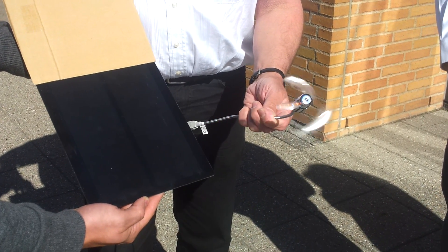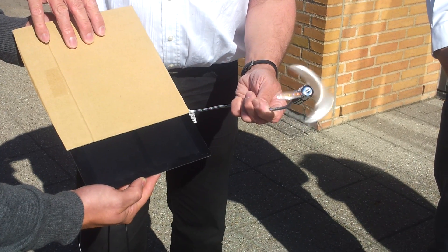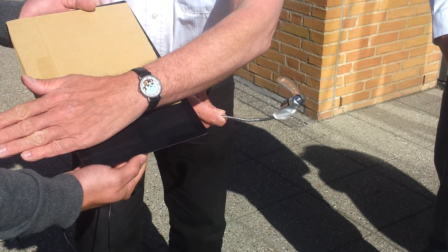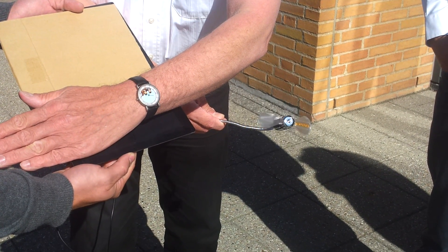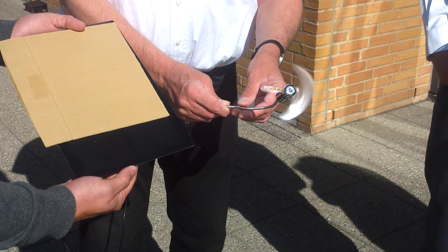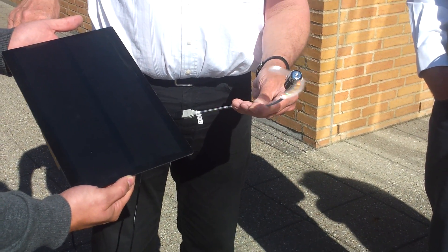With shading at 20%, 30%, 40%, 50%, 60%, 70%, 80% — I try to make a little bit more shade here — 90%, and still it turns. Now it stops, but you see it is nearly fully covered. Still the fan gets enough energy to run. So it is really quite a good explanation of the shading behavior. Thank you very much.